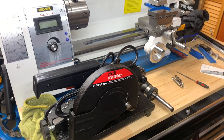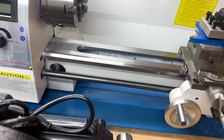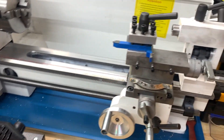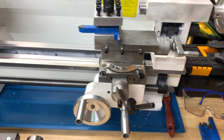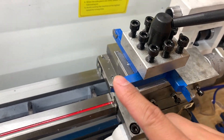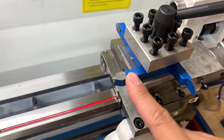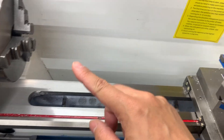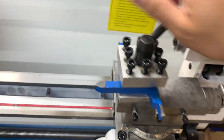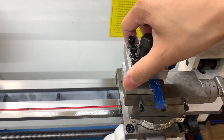This is about the third day since I've had the lathe and I've spent a few good hours working on it. I'm liking it so far. I've got it set up pretty well with a turret holding a couple bits: the parting tool, the turning tool to reduce diameter, and the facing tool. I'll just face something, loosen this, rotate it to whatever operation I need.